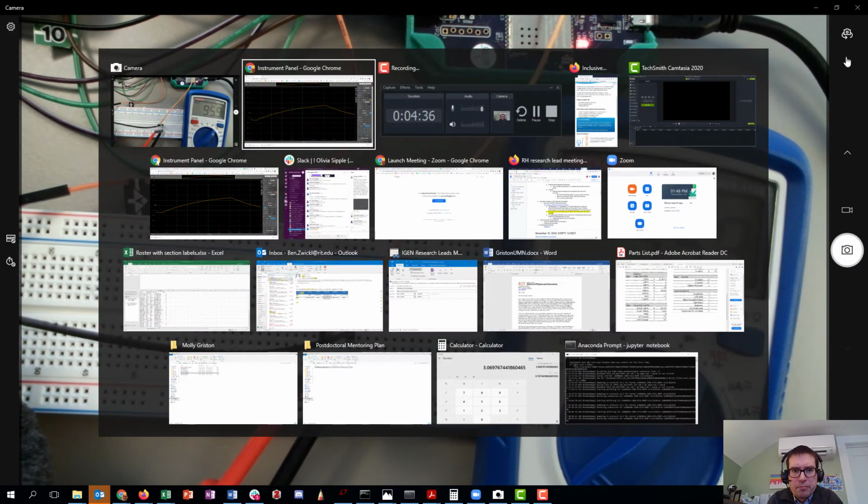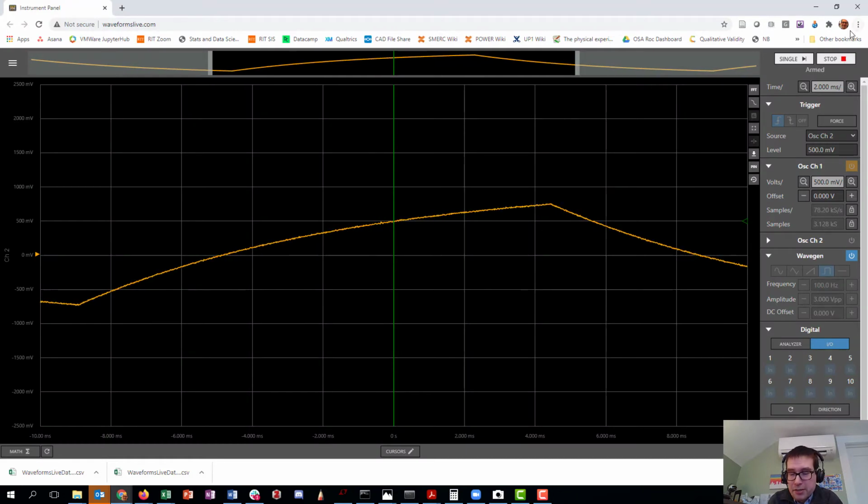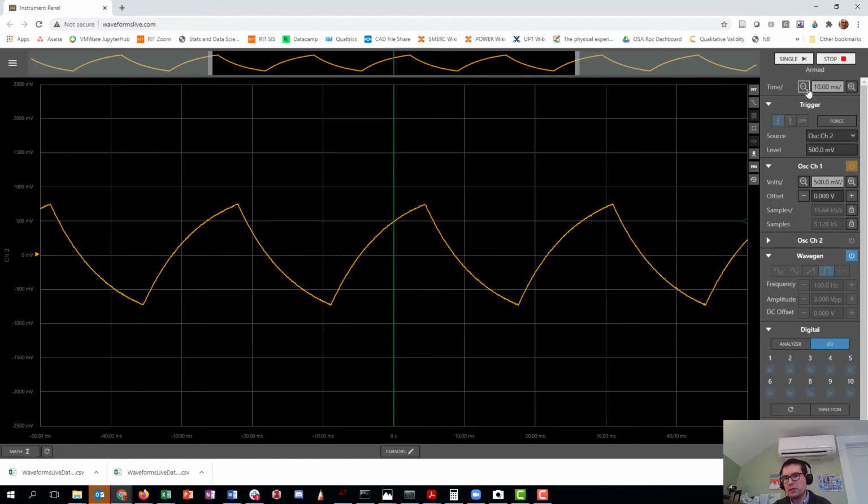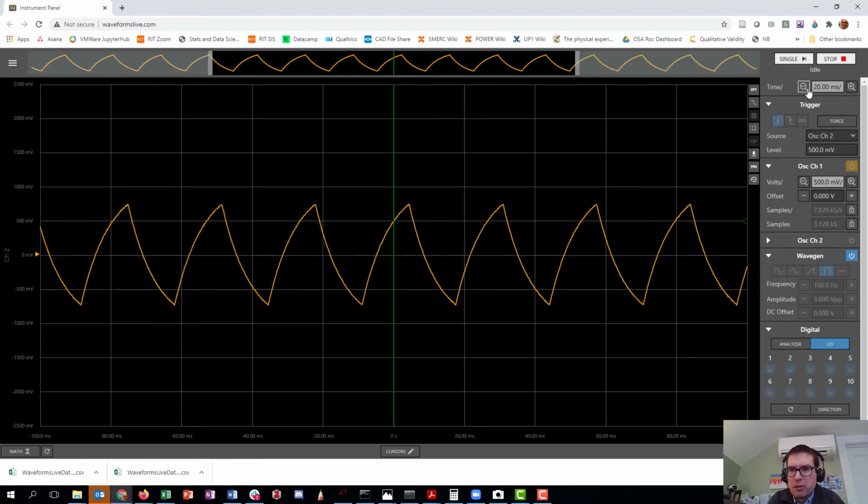If we go over to the oscilloscope, compared to the last waveform where we had a lot of different periods of this rise and decay, now because we've got a bigger capacitance, it's a longer rise time or a longer decay time. So that's what we're measuring. I had to change the time scale by 2 clicks, maybe 3, to get something similar, and every 3 clicks is like a power of 10 in terms of time. So we made the capacitance 10 times bigger. It made the rise or decay time 10 times longer, and we have a 10 times bigger capacitance, right?